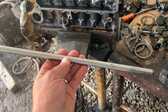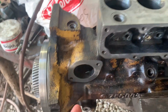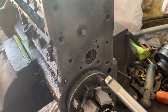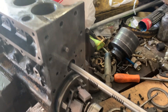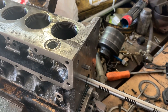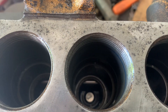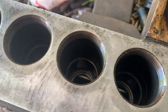Here's the rack cleaned up. The slotted end right here goes to the front so that you can see it and you can pin the rack as you put it together. It goes in that hole right there. You want to be very gentle. These teeth face toward the outside of the pump. If you look, you can actually see it going through the lifters. Very gentle - do not force it.